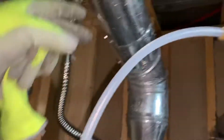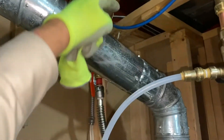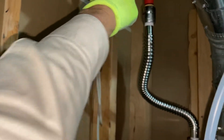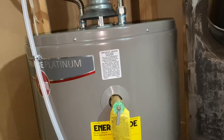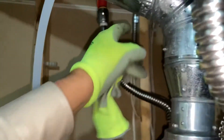We added the copper strapping to the copper piping and secured these lines. The exhaust now has clearance from the water line — before it was right up against it. We added a second isolation valve in case they ever have any problems, so we don't have to shut the whole house down. We've got our three screws on all the piping.